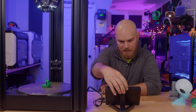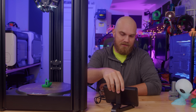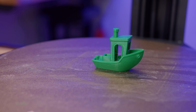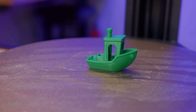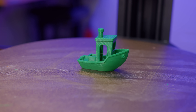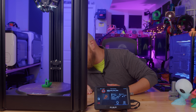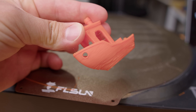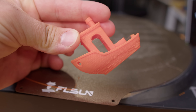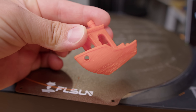The green benchy is done in 48 minutes and 54 seconds — not really super slow; I've had printers take longer. The quality is not bad for a profile I threw together pretty quickly in Prusa Slicer: about 120 millimeters a second for print speeds, around 8,000 on accelerations, 10 on jerk. I did slow down some of the external layers. The orange one printed in about 19 minutes with everything set to 400, acceleration at 12,000, jerk at 35 — just trying to zip along as fast as possible.